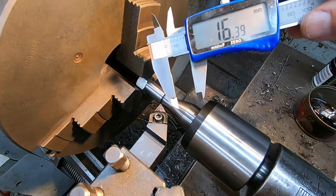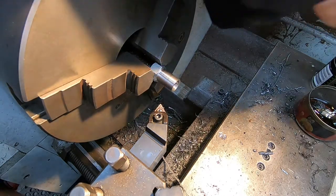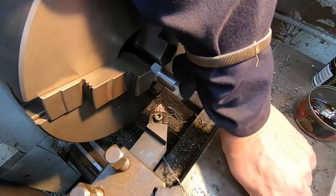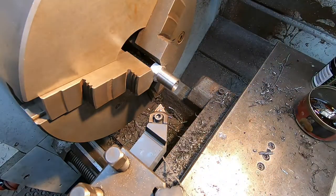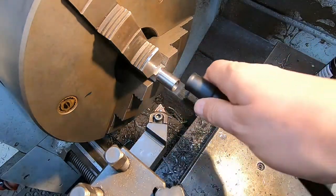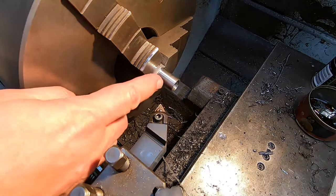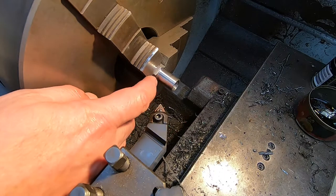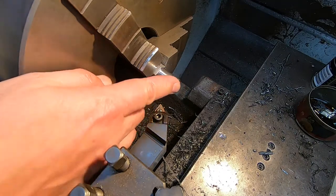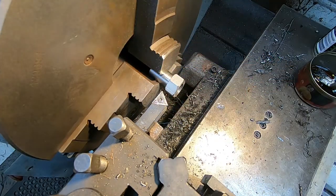Just break that burr on the end. I just noticed my sleeve hanging down so I fixed that — watch out for that on the lathe. I've got these cuff bands — I don't know what you call them — they stop the sleeve flopping around. Anyway, I'll put more of a chamfer on later but for now I just want to see whether this is anywhere near fitting. That's going to go on nicely — we'll call that done. I could put a couple of grooves on here to increase the resistance for the hose pipe pulling off, but if you remember it's an open-ended hose pipe so it can't ever have much pressure in it, so I won't bother with that. But I will put a bit of chamfer on the end. Yep, happy with that — that's it done.